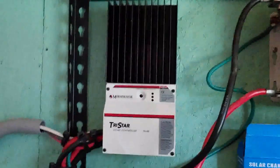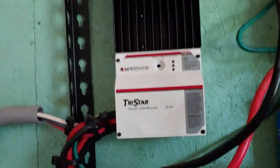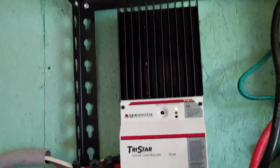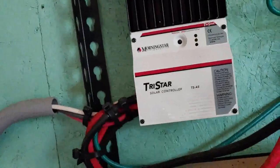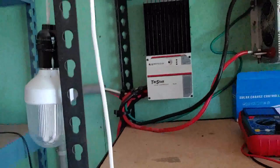So let's look at what we have here. The wires from the solar panels come into the shed through the side and go into my charge controller. This is a TriStar charge controller — it's a TS-45. You can see the light blinking green, which means the batteries are in float. They are fully charged and ready to be used. The charge controller controls how much charge goes into the batteries to make sure they don't overheat.